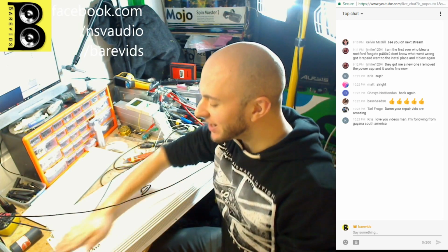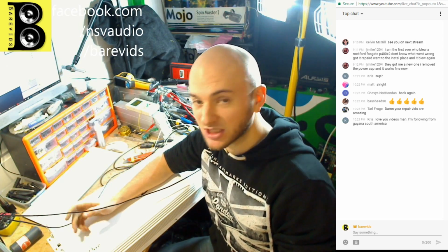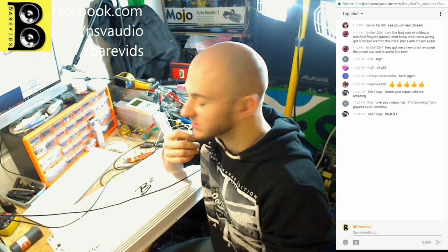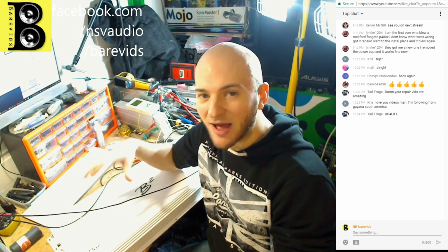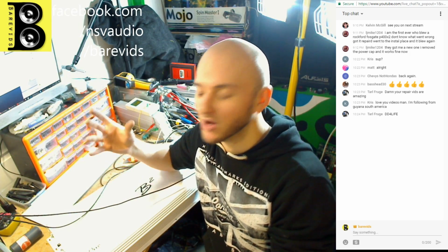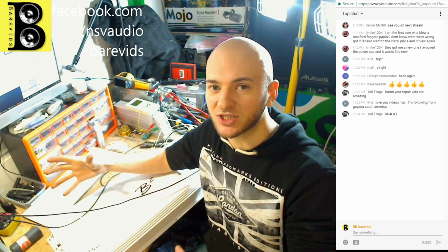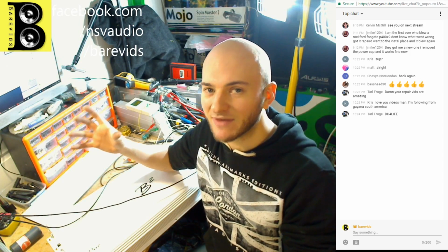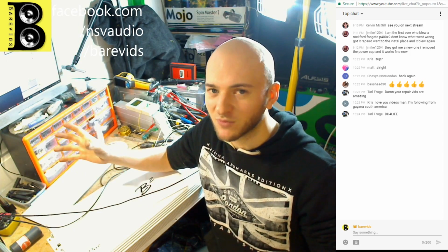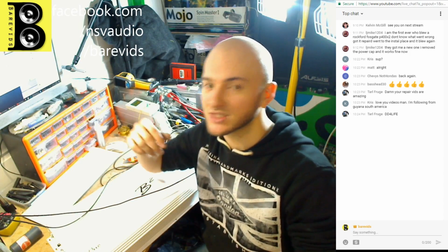The amplifier came in brand new from the factory, and the dealer who installed it into the customer's car said that it was absolutely dead, with no lights, no protection, no nothing. So he sent it off to me to diagnose, and we powered it up on my low voltage supply, 9.8 volts, which 99% of amplifiers work perfectly fine on, and power up to show you the switching frequencies and the rail voltages, etc. And the only 1% of amplifiers that I've come across, like literally two or three in the hundreds of amplifiers I've worked on, don't like powering up on the 9.8 volt supply that I use here.